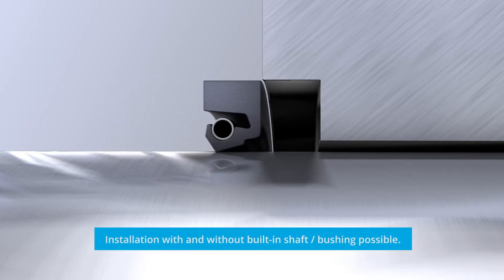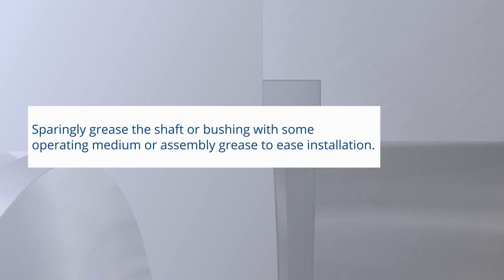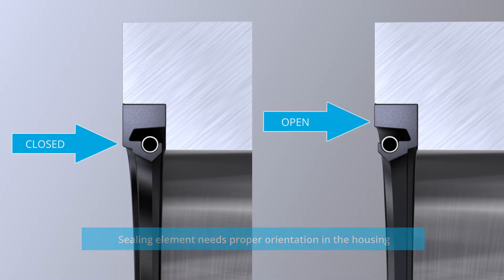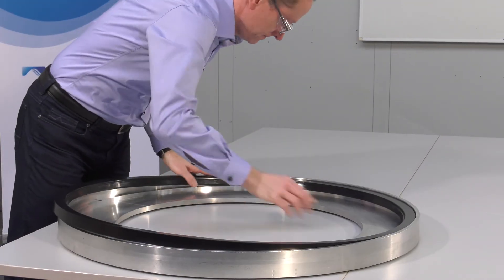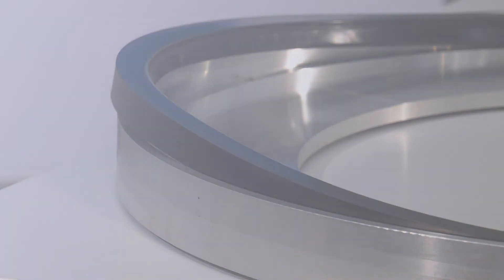Good to know for a successful installation: The installation of shaft seals is possible either with or without a previously installed shaft or bushing. Sparingly grease the shaft or bushing with some operating medium or assembly grease to ease installation. Before installation, make sure that the shaft seal is correctly aligned as shown in the drawing. Shaft seals have a so-called closed and open side. Radial shaft seals are generally supplied with excess circumference. Therefore, the following installation steps must be followed exactly so that the seal ring can be correctly positioned in the housing. Attention: when trying to install the ring starting at only one place in the housing, the excess length of the ring will form one large final loop that cannot be pressed into its final position anymore without getting damaged.